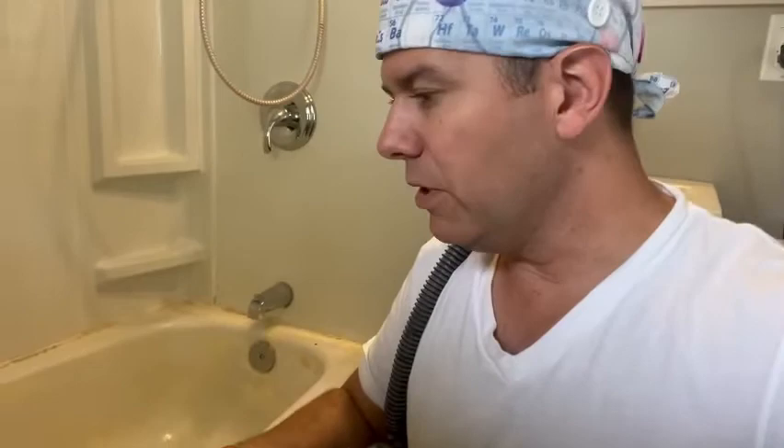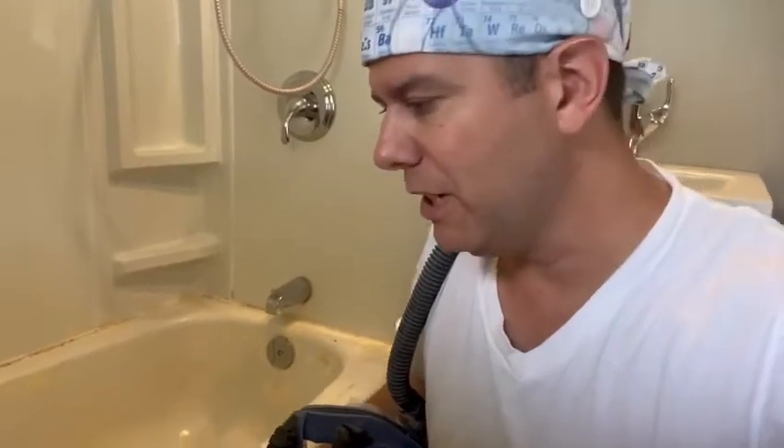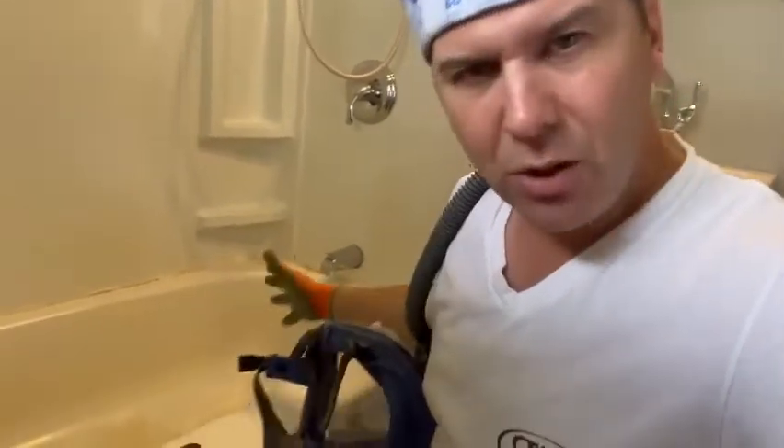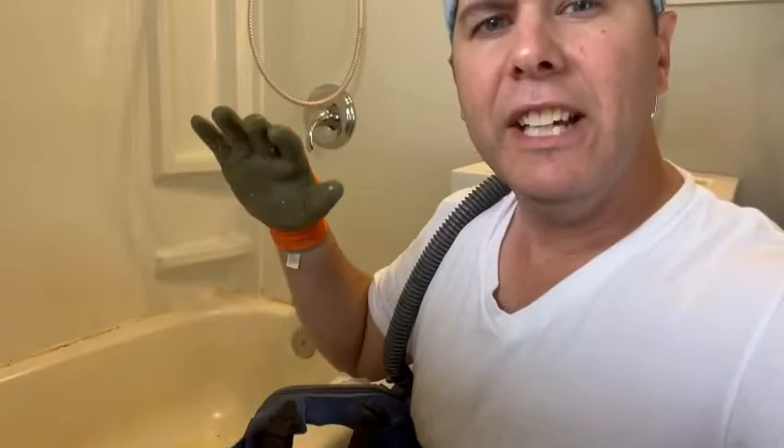I found that doing it this way — thin coats of stripper — is actually the cleanest, easiest, and fastest method. I used to grind the whole tub off with a polisher and 40 grit on a velcro backing pad, and that takes about the same amount of time but is 30 times harder physically. If you've got sore ligaments, tendonitis in your elbow, grinding will really hurt you. This way it's almost effortless. By the time you strip, clean, blow, and remove the caulking, it's about 50–60 minutes total — but much easier than grinding for 60 minutes.